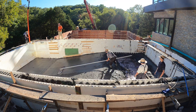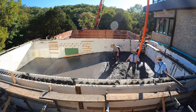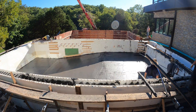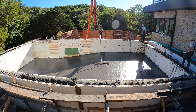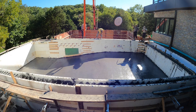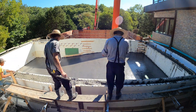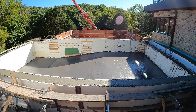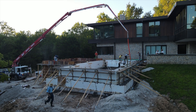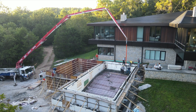That's why you'll hear me talk a lot about a four-inch slump being your ideal — it's flowable but also stackable. If you get up to a six-inch slump, like a lot of concrete guys prefer because it's so workable, you're going to get weaker concrete and it's going to be very hard to stack without a footer. The drier the mix you pour, the higher the PSI once it's cured. You can see the boys topping off the wall — everything comes together all in one piece and then we move over to pour the board form wall.